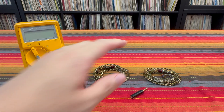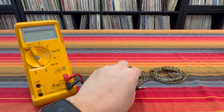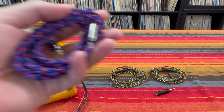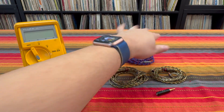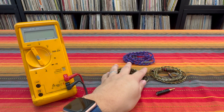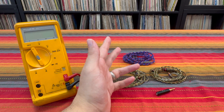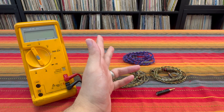The whole reason the Ruyi Rod cable sparked this investigation is that when compared to the rest of my cables from Yangtze — for example this one — all of these measured a resistance of around 0.2 to 0.4 ohms when I tested them with my meter. My Ruyi Rod, however, measured with a resistance around 15.5 to 15.2 ohms. That's a pretty big difference and it led me down this sort of rabbit hole.